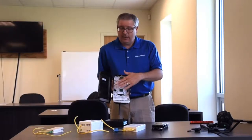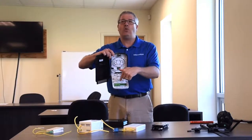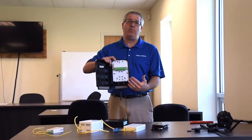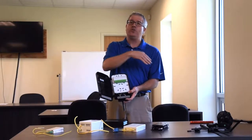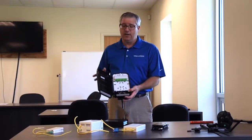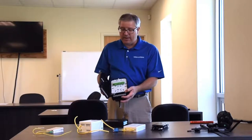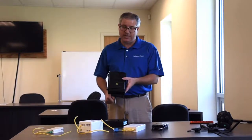Once spliced in, pigtails can be installed on the bottom side of the tray. Everything is organized and cable-routed so that once completely assembled, it locks up and only presents the drop cable ports to the installer. For homes passed, these can be run to different poles or sides of apartment buildings. When a subscriber decides to add service, the installer comes out, undoes a dust cap, plugs in a drop cable, runs it out through the bottom, and closes it up — resulting in a sealed enclosure supporting up to eight drops going to individual residences.